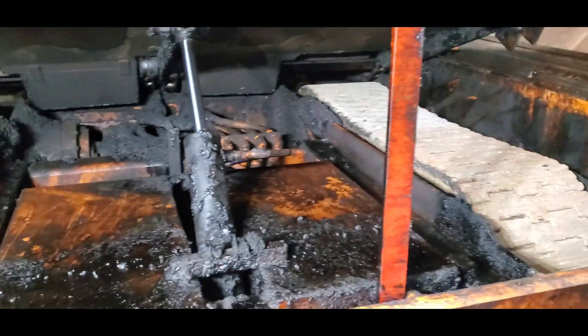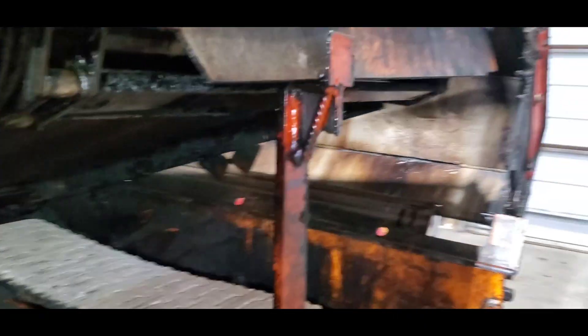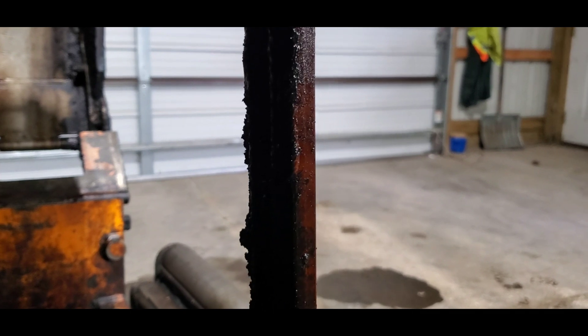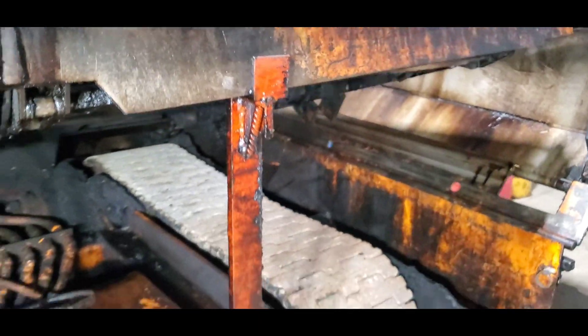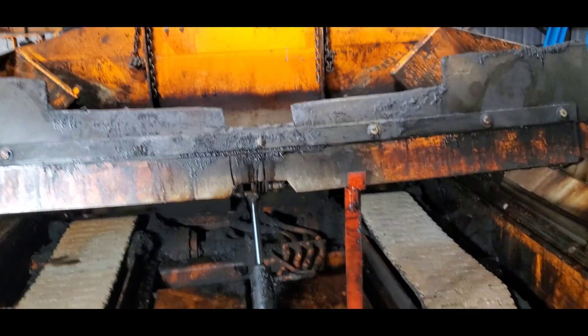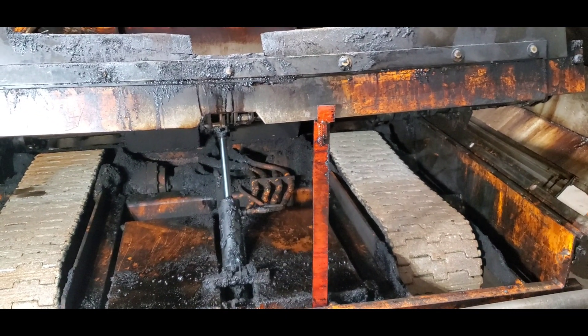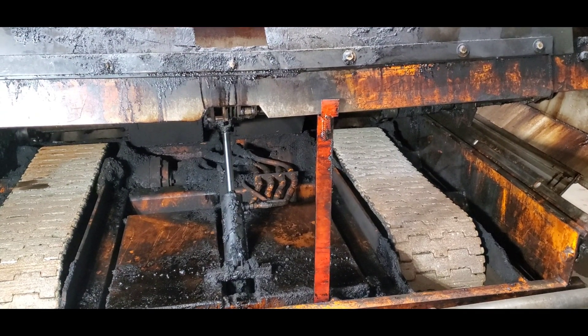Another improvement would be the safety bar. I built this safety bar out of rebar and flat bar stock, and I reinforced it on the other side. It's a piece of c-channel with rebar welded on the inside of the c-channel, and I put a rebar gusset here — because when you're underneath this thing, the last thing you want is someone to close it on you. We actually had that happen and the safety bar failed, so I created one that's a heck of a lot stronger.